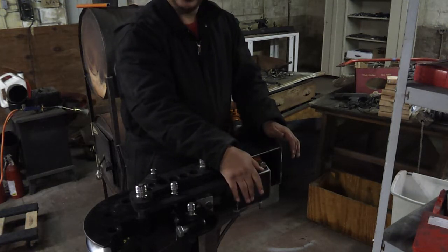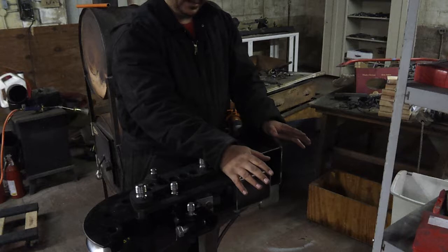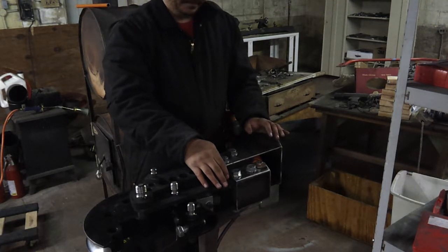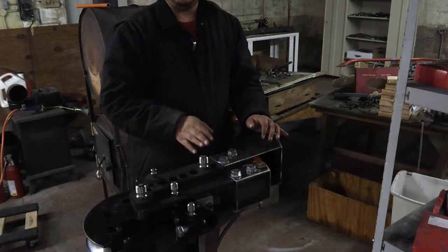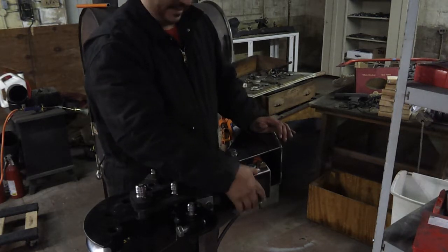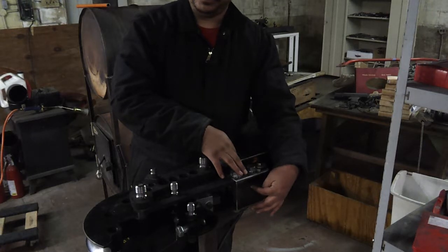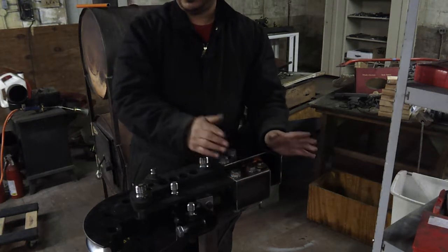This right here will more than likely be redesigned if I sell a completely built kit. If I don't, one of the other options is to sell a weld-together kit or even just sell plans for it. If that's the case, they can box all this stuff in if it really needs it, because there will be instructions on how to put it together. This works for me because I bolted this top and bottom plates down tight — as tight as they'll go — before I welded this boxed-in plate here. So it's tight. It works for mine, but it might not work on another one. That's my concern.